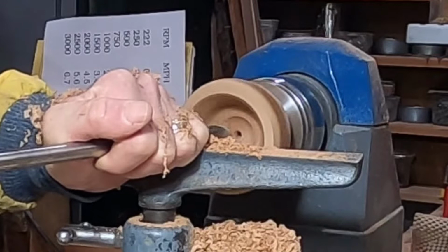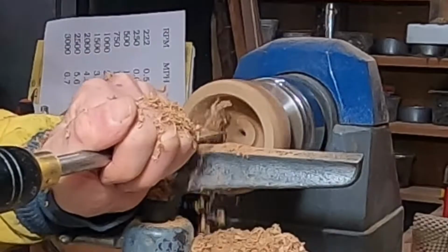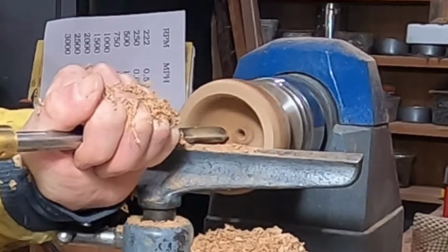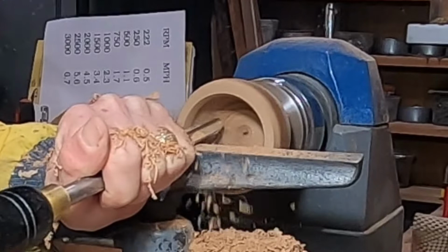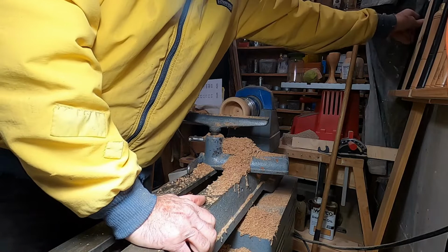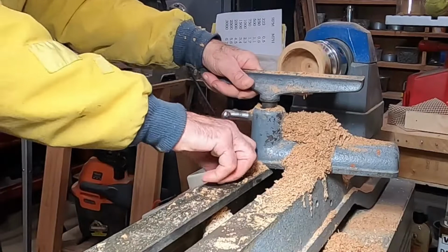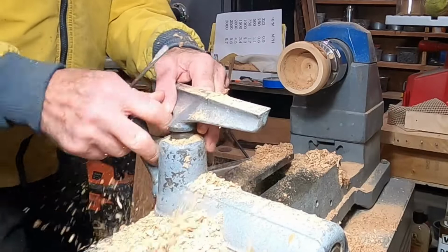I had forgotten how deep I had drilled the 5/16 inch hole to accommodate the bedpost screws. Even with a 60 degree bevel, I have a hard time making the tight corner in the bottom of the little bowl. The banjo locking lever is very stiff. I hadn't yet found the small piece of pipe I put on the handle to give me more leverage.